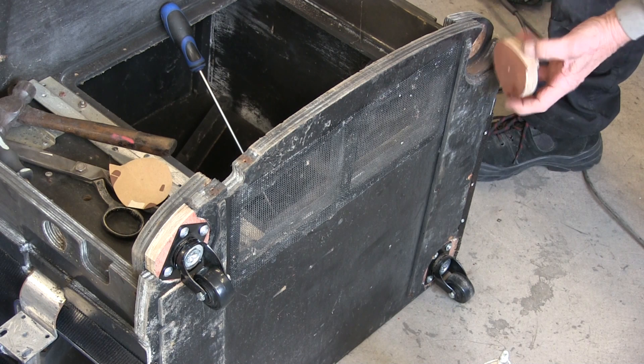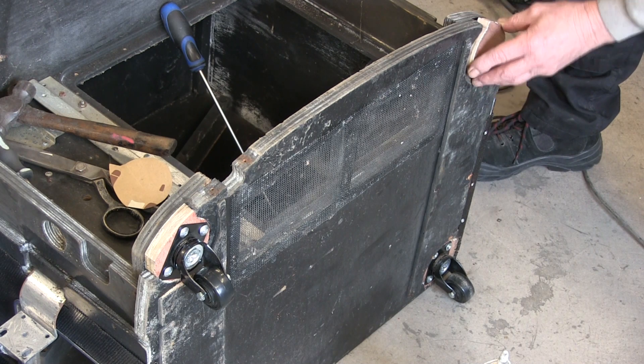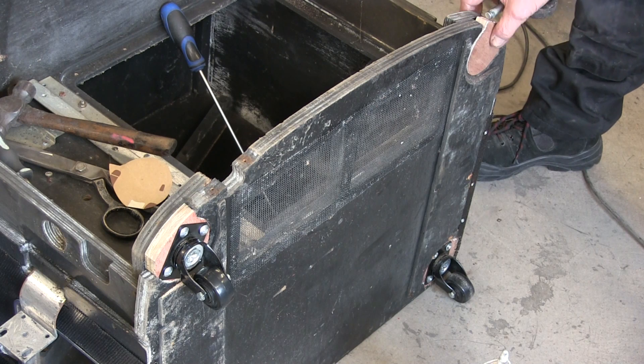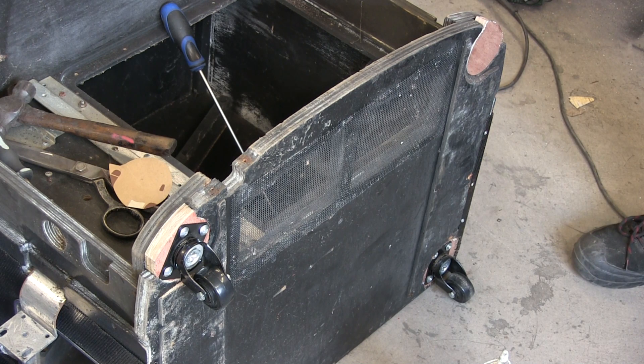I put this type on which is a flat plate, but you can't put them straight in because the wheels will touch the sides. So I just make a fillet, put that piece in - it goes in like that, goes in there, glue that in, screw in the top with a big washer pulling it in so the glue sets, and then screw those on. They're really, really good wheels. The originals have seen 60 years and they've had it - they're for the bin.